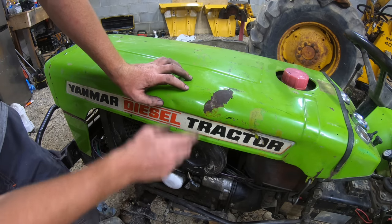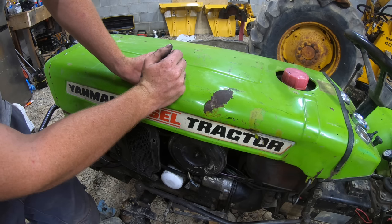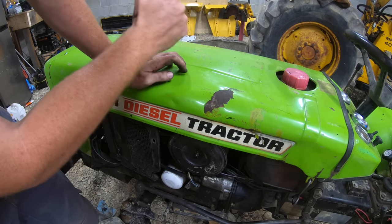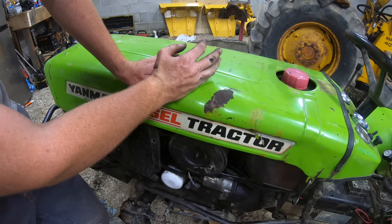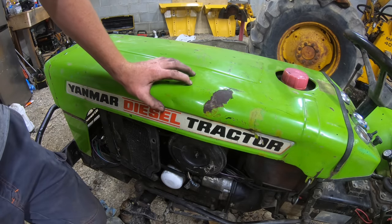But two actually turned quite a bit to get back to torque. So maybe there is something to that. Then I think they said do it again at 5 or 10 hours or something. So I probably will do that just because I would rather not change his head gasket again.